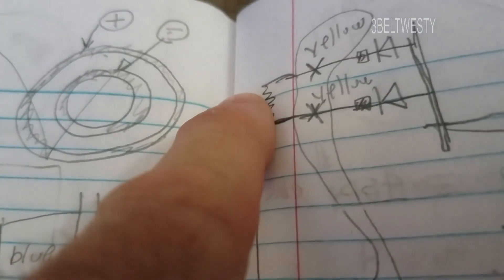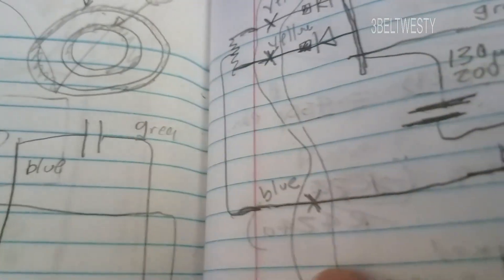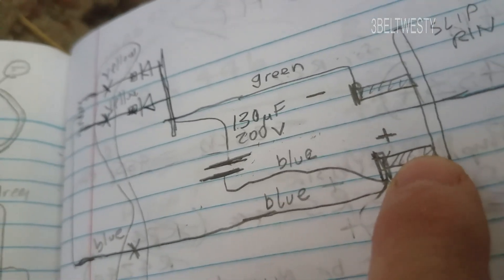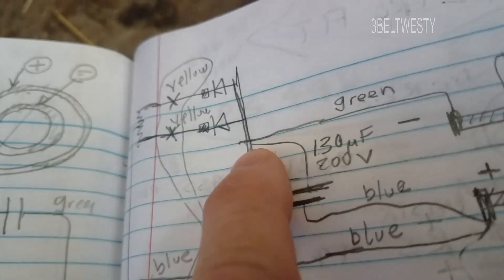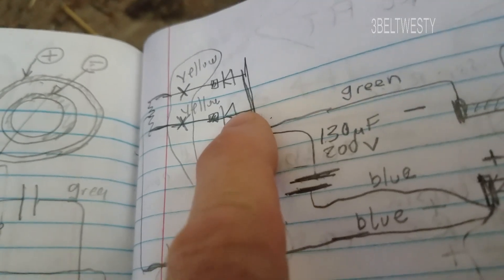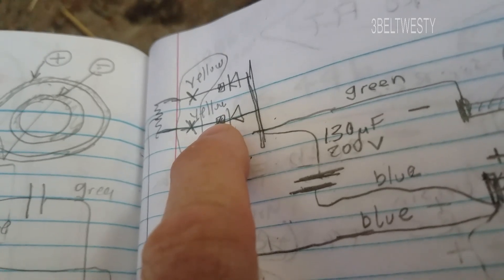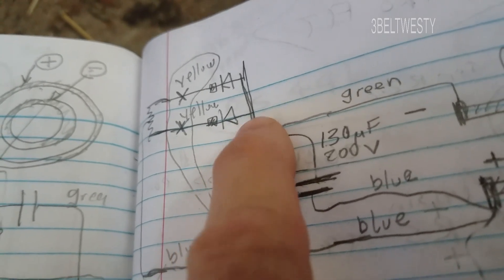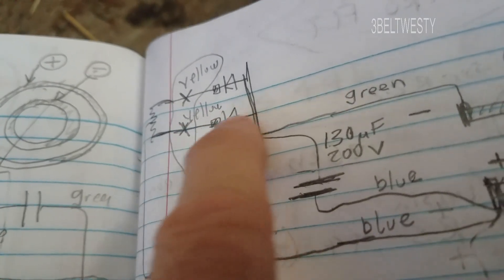Here's the polarity. The two exciter windings have two yellows and a blue. The blue wire connects to the positive terminal. You come back through the negative to a bus bar, which is the heat sink. The diodes are oriented so the part screwed to the heat sink has the arrow coming out — the threaded part is on the heat sink and current flows positive through the arrow back into the winding.